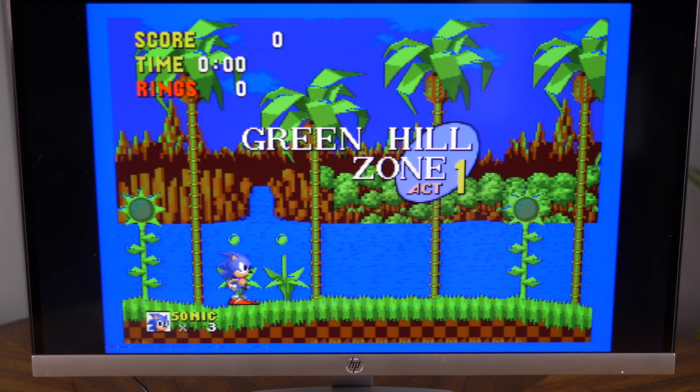Speaking of high quality, there's something I noticed when testing the RAD2X. Since the scaling is only 2x to 480p, the typical video noise you'll see in Genesis 1's isn't as noticeable. Here's a completely stock Genesis 1 running through the RAD2X in 480p on my 1080p monitor. Now here's that same Genesis 1 running through the open source scan converter in 1080p. While the image is much sharper, everything about the signal gets scaled, including the jailbar interference, making it much more noticeable. In this situation, the RAD2X actually looked better.